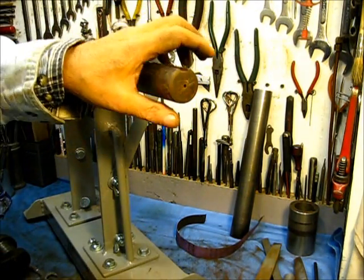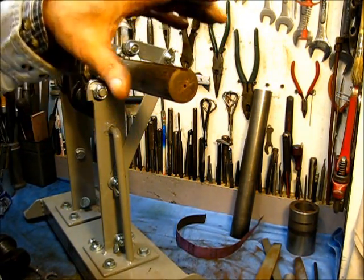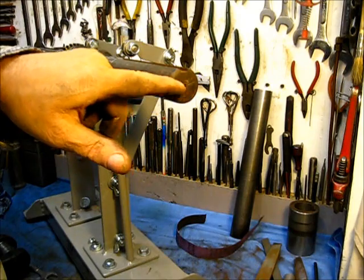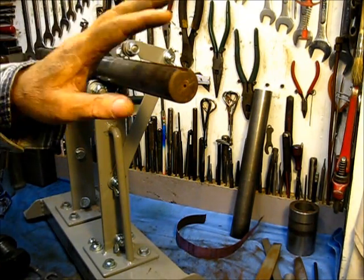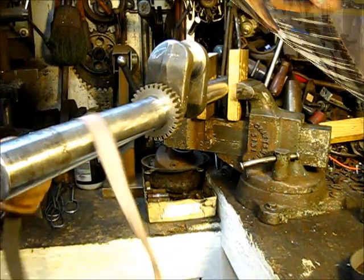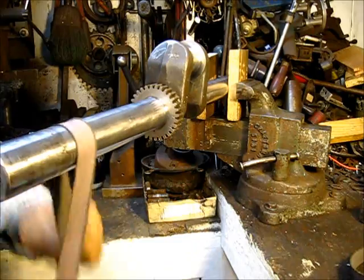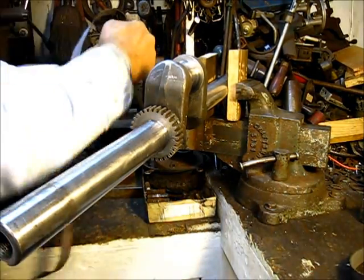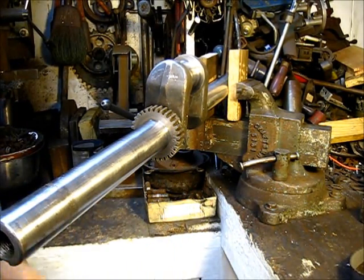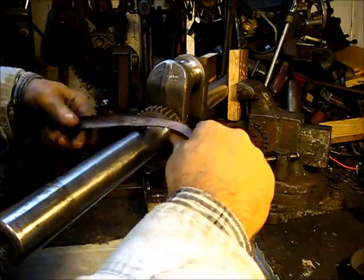The apparatus is much the easier of the two options, and there would be a situation where I would put this into the lathe and find a new center. I would do that on a different brand, probably, where I was going to do it on each end. A little bit of 180, followed up maybe with a little 240, and then just the polish, very, very smooth. And on that last polish, you want to have some paper that is worn plumb total out.